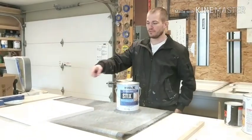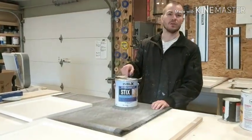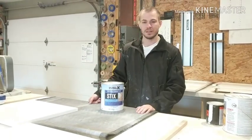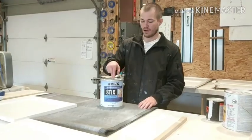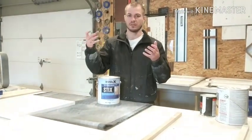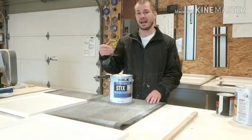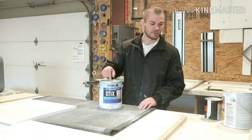The most important part of making oak look like that starts with something like this — a really high-quality bonding primer. It makes anything stick to anything. There are people who say you can use de-waxed shellac for the same thing, but I've never gotten great results with it. This is the first thing you lay down. You sand the oak doors so you've got a mechanical tooth that this stuff can stick to, then lay it down with a sprayer. You can use a really cheap sprayer — the sprayer isn't as important for these base coats as the sanding is.